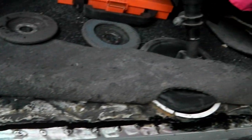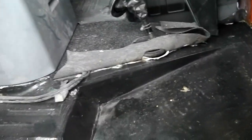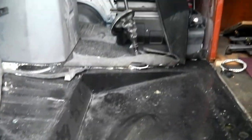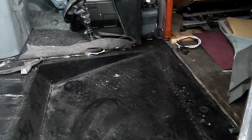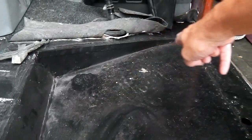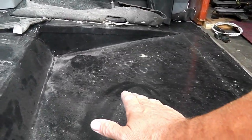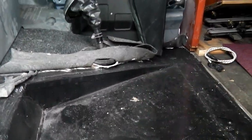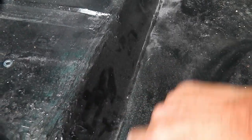Just brushed it on, squirted in with a gun and then brushed with a disposable brush around all of the seams I've welded - not hiding anything, I just want it airtight and watertight. So to recap: we took out the fiberglass steps that were the main entrance and exit to the vehicle, cut all that out leaving the big hole, welded in a new standard footwell panel, and put a big piece of two millimeter metal floor all the way around the outside. Slightly different from standard because standard would have the floor angled up to a slope, but I've got plans for those seat runners.